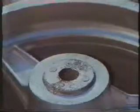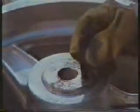The bottom half, which holds the casting and its runners and risers, breaks into 3 pieces so that the casting can be released easily. It's now fallen to a temperature of 400 degrees centigrade, and it can be handled, carefully of course, with a pair of tongs. Each wheel is stamped with the date and the batch code number so that it can be traced back to its origin if there should be any fault or failure in the future.